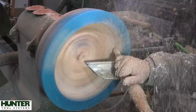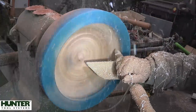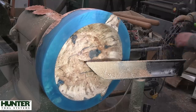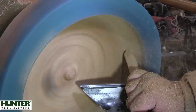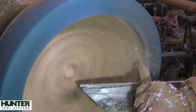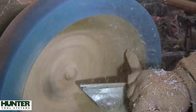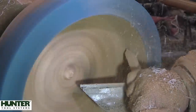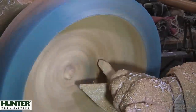Those I would classify as being finishing cuts — typically long sweeping cuts. We are going to have to do some filling on this, so I'm just trying to improve the surface reasonably well before we do any filling. I find it's easier to locate where the cracks are if you improve the surface first — that's why I like to do it that way.